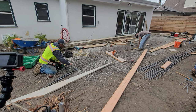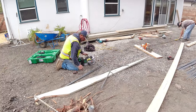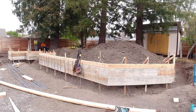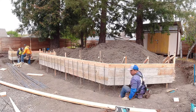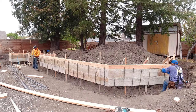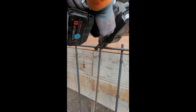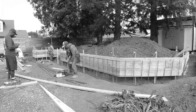Having the right tools, especially in this crazy labor market, is key for productivity. We have the cordless rebar cutter and bender, and also a standalone cutter for our rebar. All rebar we use for our retaining walls is pretty much 12 inches on center unless plans call for something different — both in the wall and the footing itself. This footing is about 32 inches wide and 15 inches thick, all number five rebar at 12 inches on center. We also have a rebar tying gun, which is a total time saver — it beats tying by hand tremendously. I'm going to do a video comparing one guy tying by hand versus using the rebar gun, but I already know the outcome.